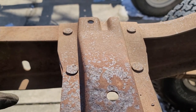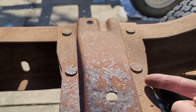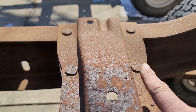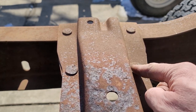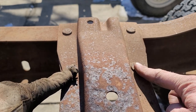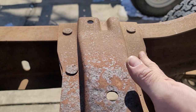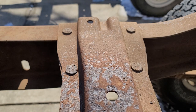We're gonna go ahead and get these rivets out of here. A method I find works really good is if you just take a grinding wheel and cut slits in them. If you can get to both directions — this way and this way — I would do like a number sign or tic-tac-toe board across it, and it's real easy to shear off the face of that. But in this case on these two I can't do a tic-tac-toe board, so I'm just gonna do vertical. Here I might be able to do some more, but it just makes it easier to take a smaller piece of the pie out of the rivet with your gun.